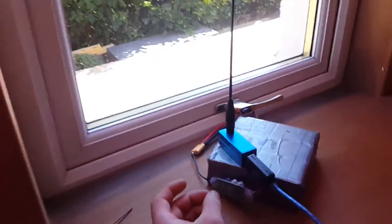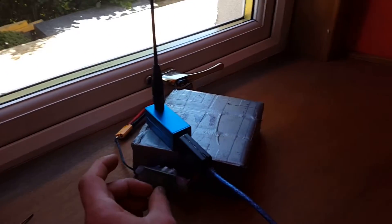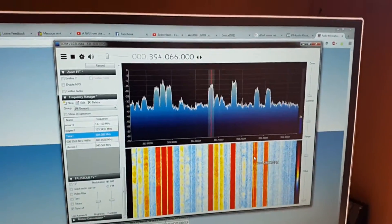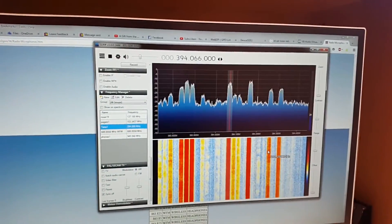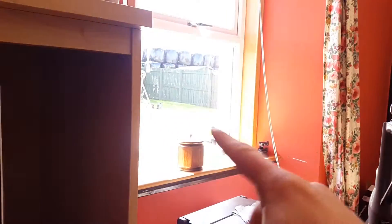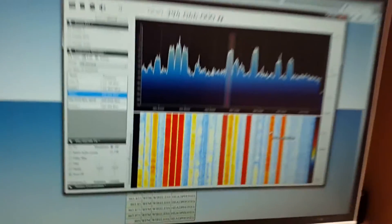After much playing about with voltages, I've just set it to 5.2 volts - well 5.19 actually - and this is just the battery powering it. And here it is picking up strong TETRA signals in the area. That is working really well. Just with a standard USB cable at the window there's a lot of noise, and that's coming off a computer power supply.